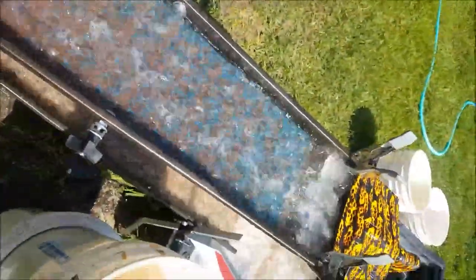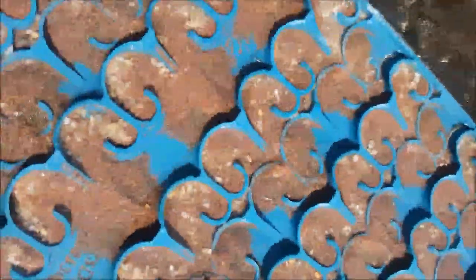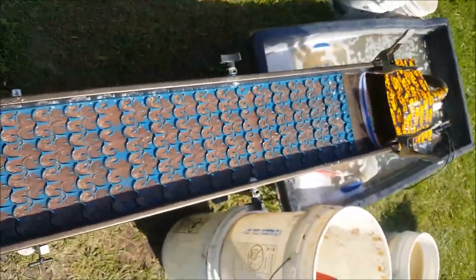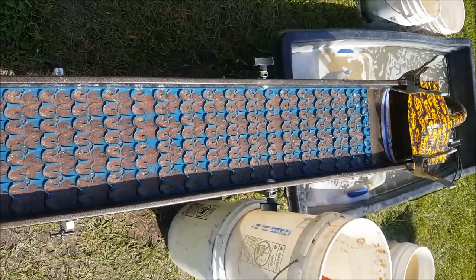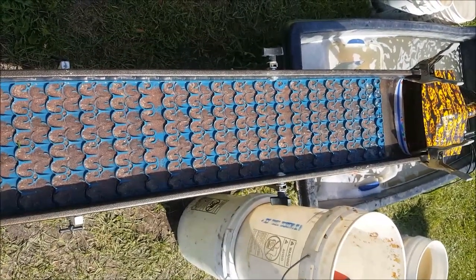Exchange that material out. In the third run, cells are still filling up with tungsten, basically full of tungsten up front. More sinkers, just red stuff, tungsten chips, tungsten wire. Like right there, just getting littered throughout the box. So it'll give me a good example of losses. We had probably a pound and a half of tungsten shavings. Most of it was probably under 100 mesh. A lot of it was just dust that was beyond 200, just down to nothing.